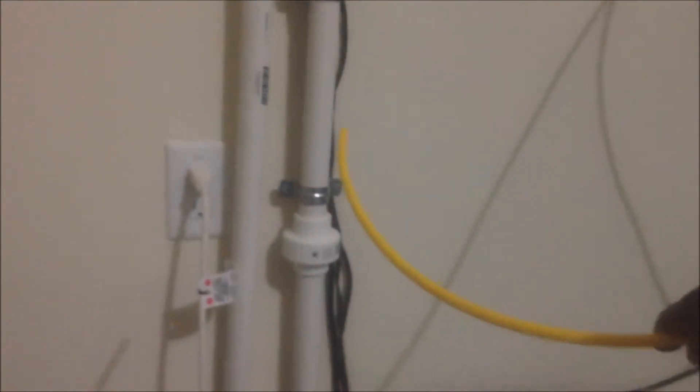For that I'm going to need a T — a 3 inch T by 1 inch. The two ends of the T are going to be 3 inches and the middle of the T is going to be 1 inch, to tie that 1 inch pipe in there. Then I could also add a T for my RODI unit waste water, so it'll pipe in there too — that way I don't have to worry about it, the water just goes right on out.